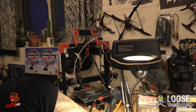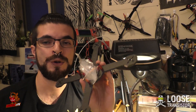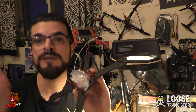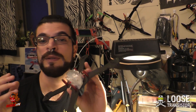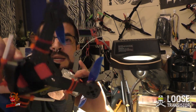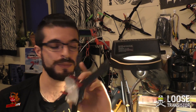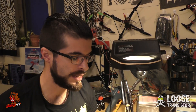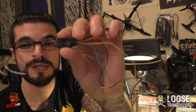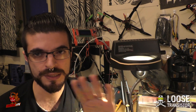This quad is going to be built on top of one of my test frame quads, which is basically a MIA X — so this guy right here. The reason I'm building it on this is because it's a platform I've flown a lot. I know it very very well and I've tested many components and configurations on it, so I get a very even perspective on different components since the frame is not really a variable. It's going to be running the RunCam Micro Swift, an RXSR receiver — which I've really come to like and trust. They have great range and reception as long as you mount the antennas nice and straight.